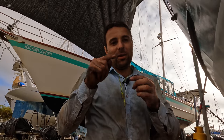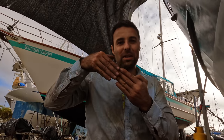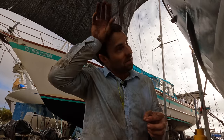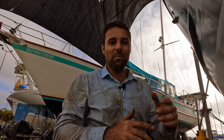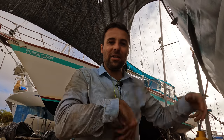But the challenge is that I haven't quite got them perfect, so they're too big for the hole, so they're hitting each other when I try to jack it forward. I thought it might be small enough that I could just put the jack in there and give it the heebie-jeebies and sort of bong it into place, but it's not happening. So I'll probably need to get the gas torch in there. You can't be tight if you're liquid, basically. Get the gas torch in there and just make it red and they'll move. But the jack will also crash down, so I'll do that standing off to the side and allow the jack to crash down in a graceful and elegant engineering maneuver. Swan Lake would be proud.